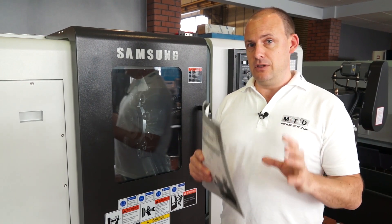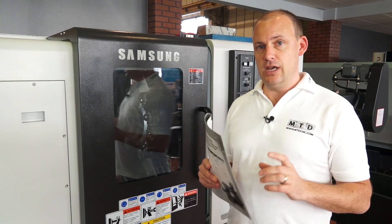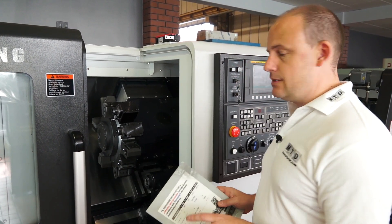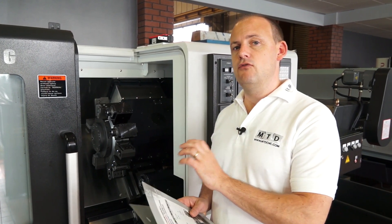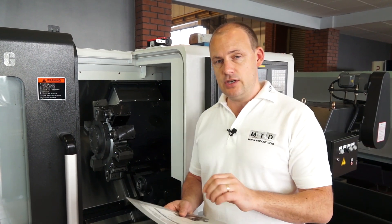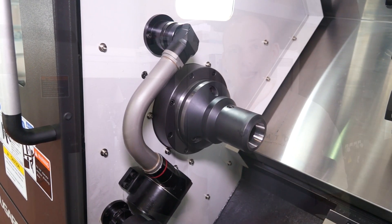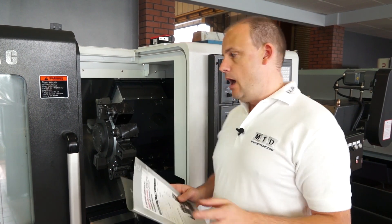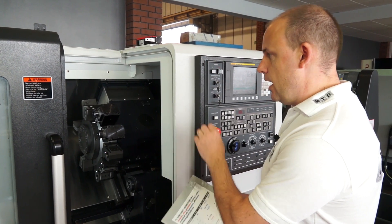So those are a couple of key factors when it comes to the build of the machine — now let's have a look inside the machine itself. In addition to build quality you need to know the size and capacity. The PL1600 is actually a six-inch chuck machine, and this is the 1600M, which means it's got driven tools, allowing you to perform drilling and milling operations as well as turning. The machine has 291 millimetres in machining length capability and 165 millimetres in turning diameter capability, so it is a small machine. It also has a tail stock, and the turret is a 12-station turret with driven tools.